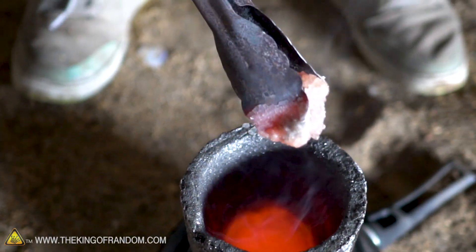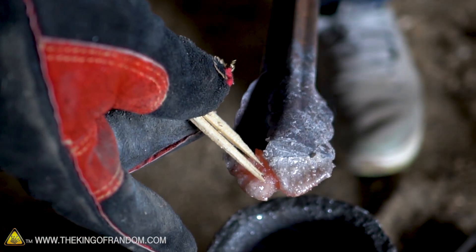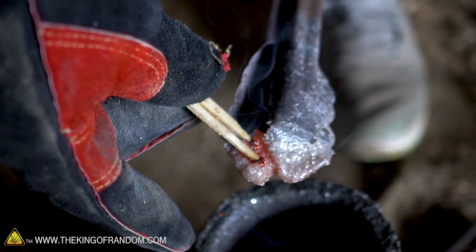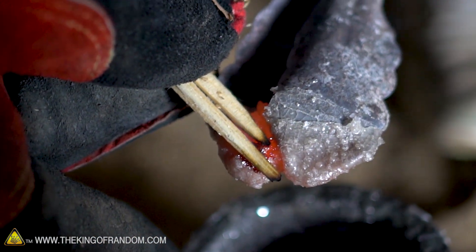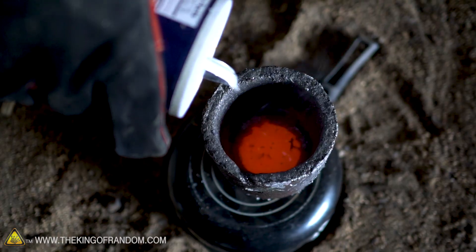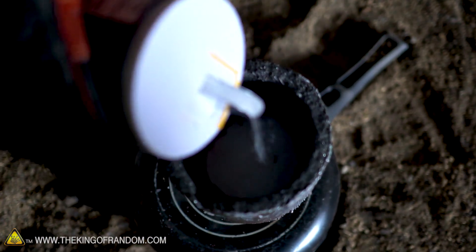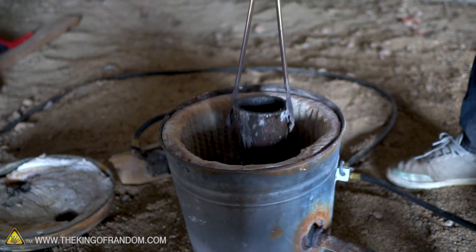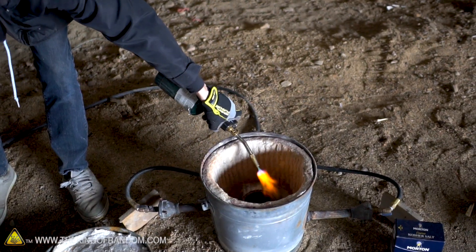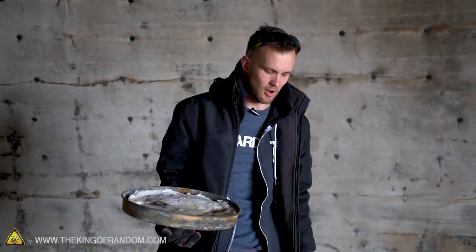Salt is not so liquid once we scoop it out. I think it's definitely cooling down. Now we have almost like a salt slush. It doesn't look quite as warm, but you can see that it still burns the piece of wood almost immediately. So it is cooler, but it's not cold. Let's pour a little bit more salt on top of this and throw it back in the furnace to get it back to nice and runny. This time we'll put the lid on — that might speed up the process. The fact that our crucible is already extremely hot should also make it go faster.